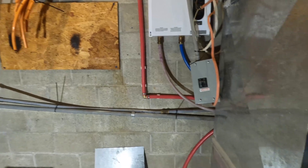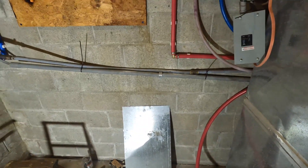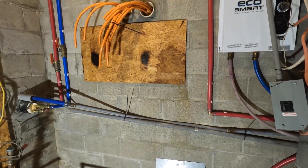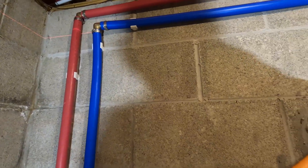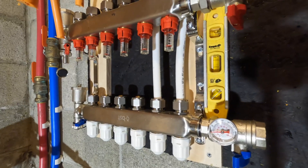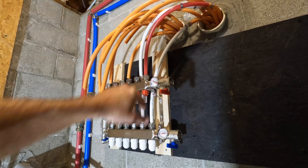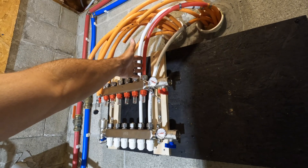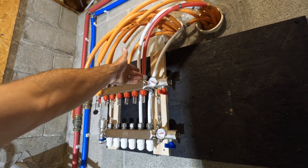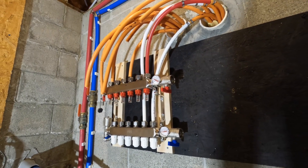It goes around, goes down, goes into my heat exchanger on my forced air heating, comes out of the heat exchanger right there, and I'm going to be connecting into the new manifold I purchased — that'll be here Friday. Those hangers are working really, really well. I was able to get my manifold mounted to the wall. At the top here I am splicing in my orange pipe, so I am color coding it — red is going to be for hot, and I'm running the opposite one for the cold, which is white. I'm trying to keep things nice and tidy.